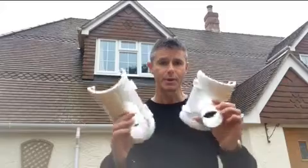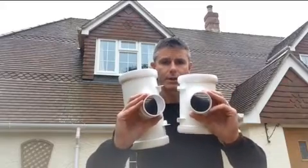Otherwise it uses exactly the same rainwater pipe — a 68mm down pipe — it doesn't need to be any larger. The capacity of a gutter is always actually in the guttering, not in the down pipe. The down pipe capacity is always way larger than the gutter itself.